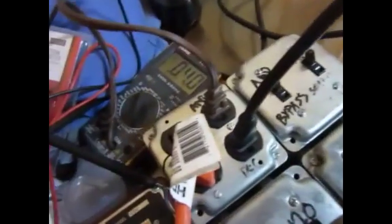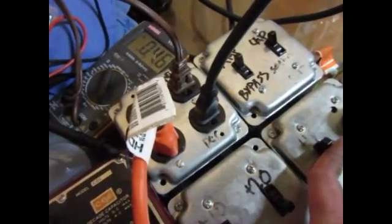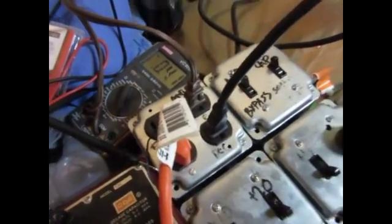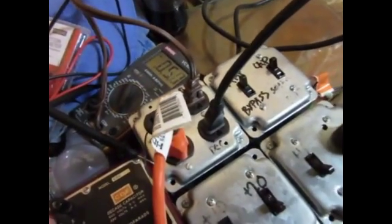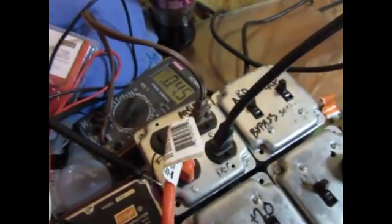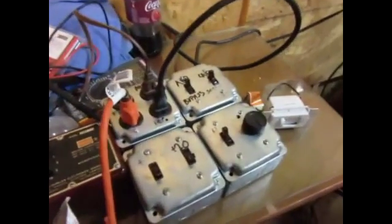I'm literally at high on C8. Watch this — at C8, I'm going to flip the high switch: 0.45A. Drop it down: 0.41A. So I'm really close. Going to C9 — I'm already over. I flip it to C9, show I'm already over, hit the high switch. So I can definitely not use a 5-10-15 on here.